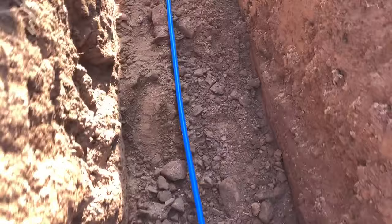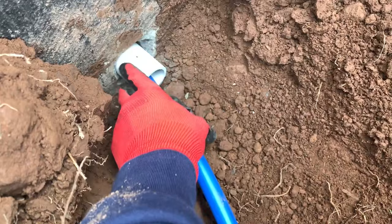Since there's weight on this block it busts through pretty clean. I put the PEX right into the ditch and where I took it into the house, I put a one-and-a-half-inch piece of pipe and fished it through so it isn't up against the rough edges of the block where I busted out.